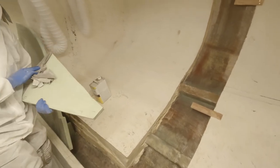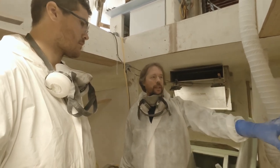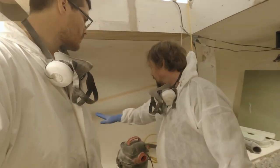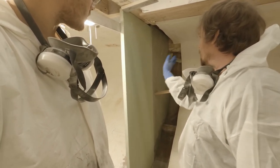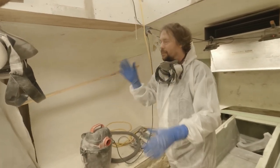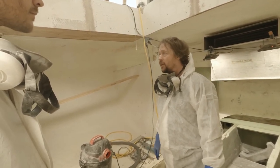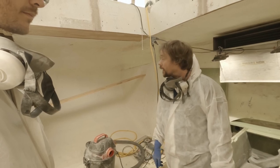And after that, we fit in the last chunk of our bulkhead. So now we can get this piece glued in permanently and tabbed, and then we'll be able to put in the next layer of this bulkhead. This piece can go in, and then the doubler piece can go on here. And we can do the same on that side. We have to wait on this last center piece until we get our tail shaft here, because we'll be able to drop that in through the fish hold and put it back in just the opposite of the way the old one came out.